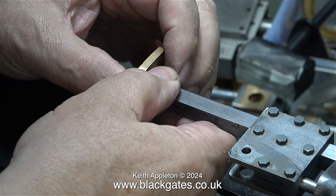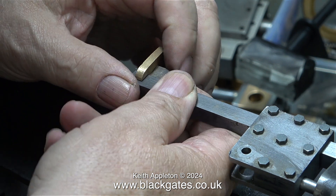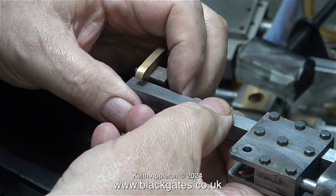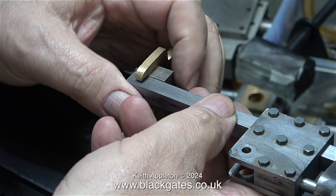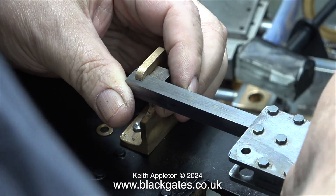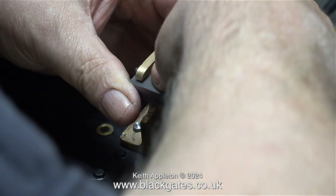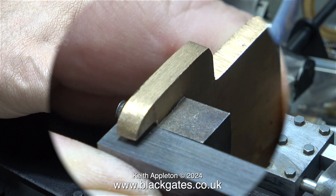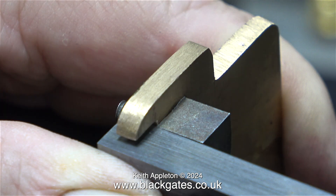This however is not always the case. Sometimes on crosshead guides you do have to correct slight misalignment using gaskets or even thin shim steel. On this engine the mounting of the crosshead guides at the cylinder end is slightly less than perfect, so I may have to use a gasket, although it's very slight and I'm sure it would wear in after a few runs. The clearance between the motion bracket and the guide bar in this case is intentional, to allow for a bit of side play should it be required.